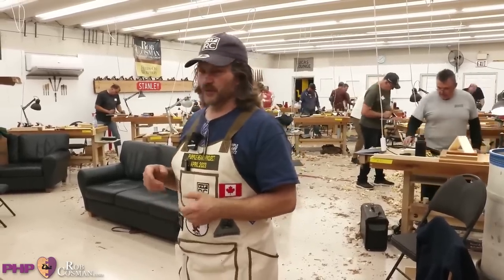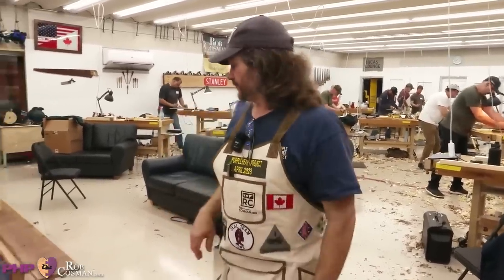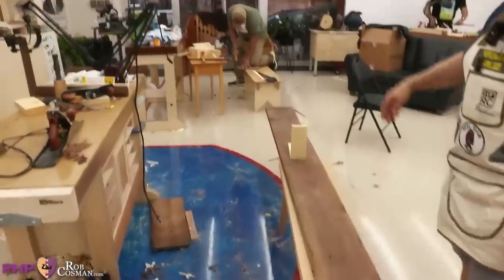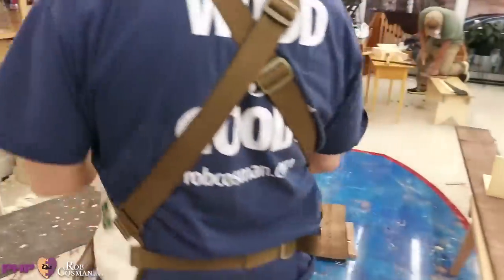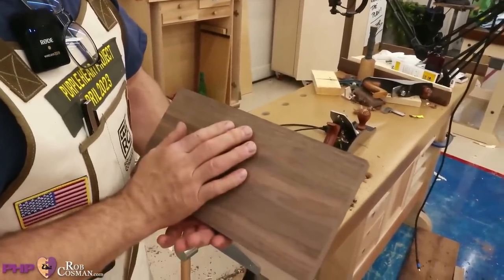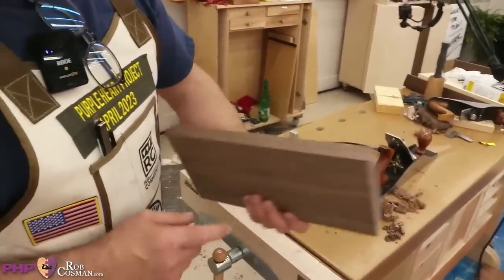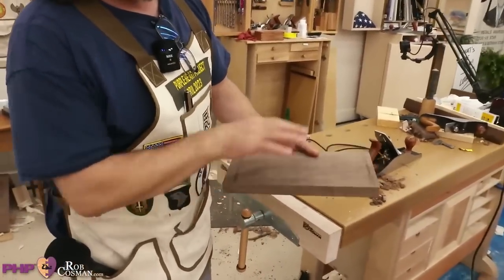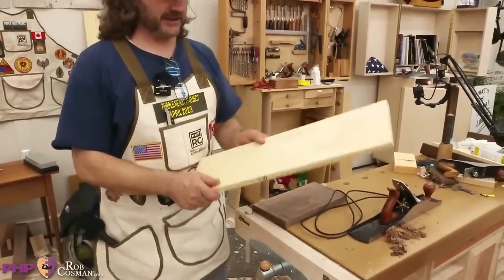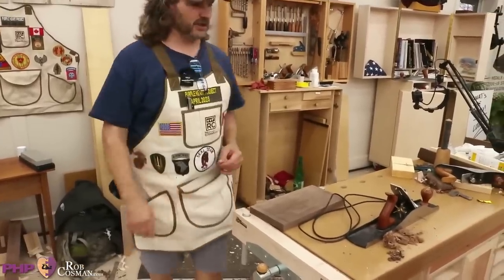Today they're working on the walnut piece. In the class, we teach them on Wednesday how to prep a piece of rough lumber. We take a piece of rough walnut, saw a piece off, and then using just a scrub plane and a hand plane, they process it — first making the surface flat and smooth, then squaring and straightening an edge, making another edge square and parallel, cleaning up the ends, using a marking gauge to take it down to three-quarters of an inch. We're using a piece of pine they've taken down to five-eighths of an inch.